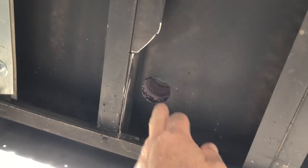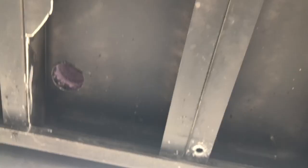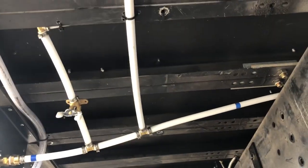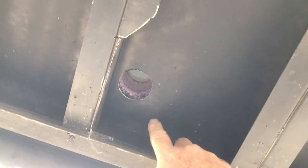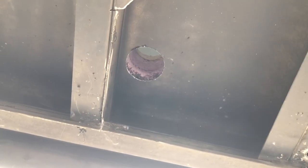Got that flange out of the way so now my pipe can come down to the gray tank. It's gonna be pretty easy to get the water over here, so I think the best thing to do is put both of the water lines up right in here - that'll make them central. The sink and utility lines all go up through the middle, so I'm gonna go drill those through.